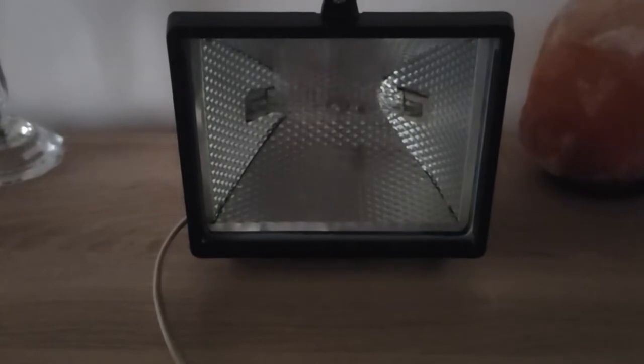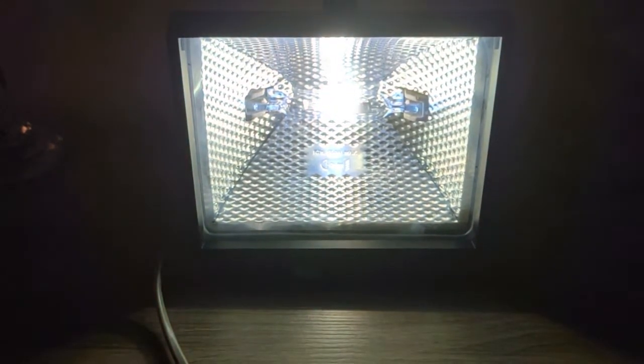Let's start it. There we go. We saw this magenta at the beginning — that's really an interesting color whenever I see with this start-up. I'm going to point it at the wall because now it's not blinking, but it will blink. It might actually have to do something with the ballast I'm using. It's a magnetic one, made also for high-pressure lamps, which I really like — but it's just not electronic, and blinking is just a part of it.